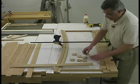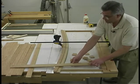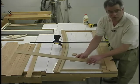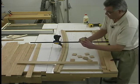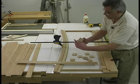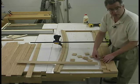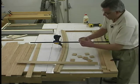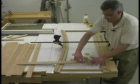Our next step is to install these spacer blocks between each of the slats. Now the slats, of course, are all the same width, and so should the spacer blocks. And if you look at the spacer block, I've just ripped a piece of 3/8 thick material to a width that's large enough to cover the gap. Then I've cut them all to the same length, which is equal to the width of each of the slats.